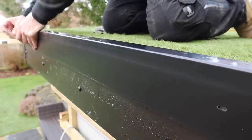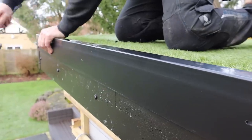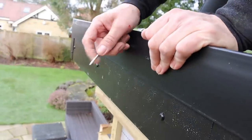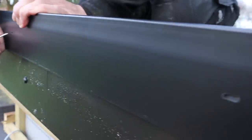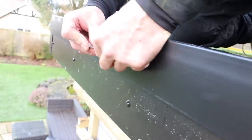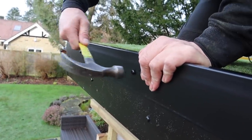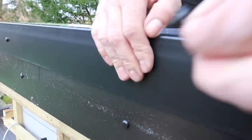I'm going to push that down tight back to the building. Now let me explain these poly tops and the reason why they've got big slotted holes in them. Plastic expands in the heat — you can see the slotted hole there. You need to put your nail in halfway so it allows the plastic to slide backwards and forwards. It won't do that if you drive your nail all the way home, so just send it so it's nearly home.